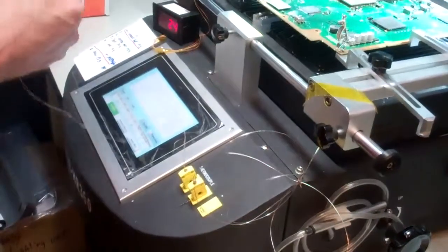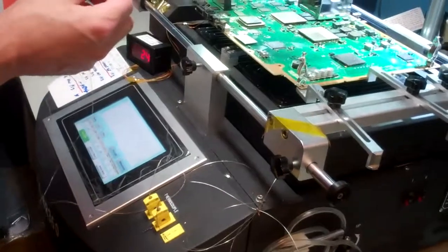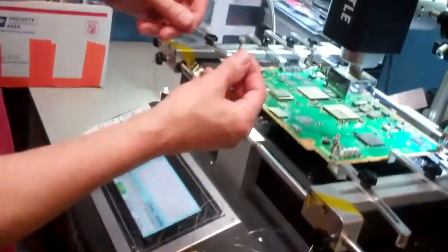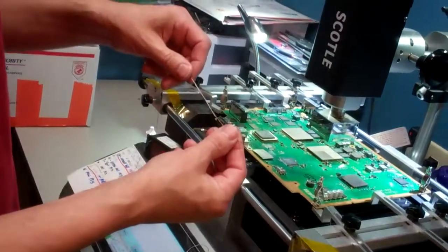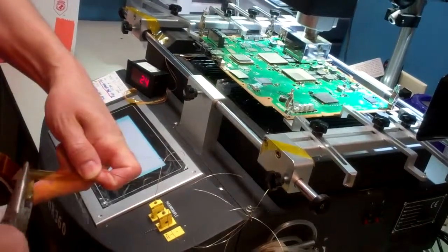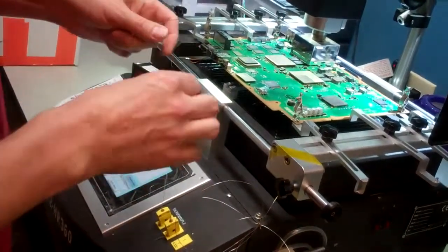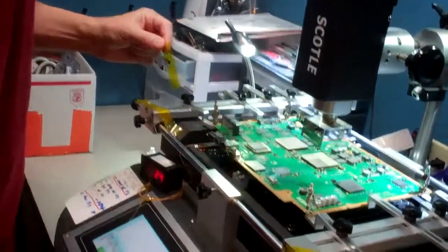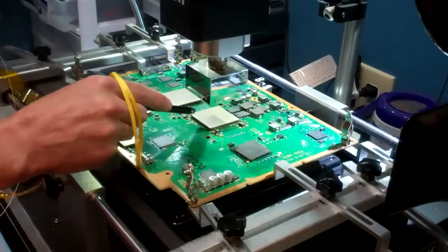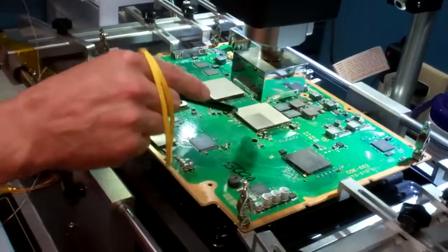This is our bottom air flow probe here — this is not used. That's a test jack right there that currently is not in any of our production models. So what we're going to do is straighten out our primary wire, which is the fine probe. This slides under the heat spreader on the GPU. So we're going to get ourselves a fresh piece of Kapton tape. Now on the GPU here on the PS3, what you're going to see is you have four sides to the PS3 and then you have the CPU over here.